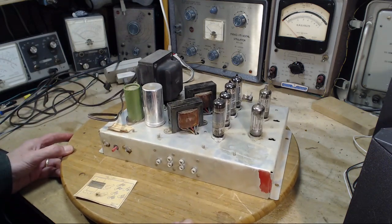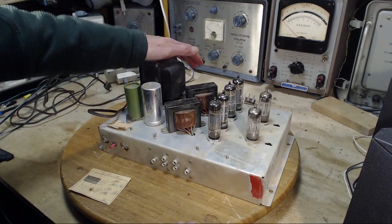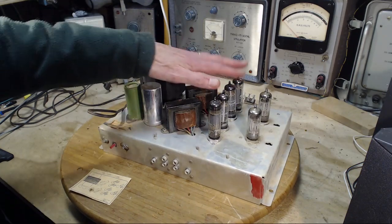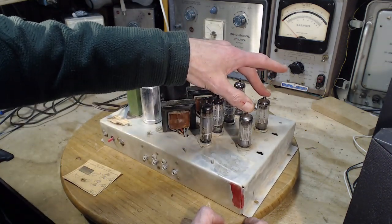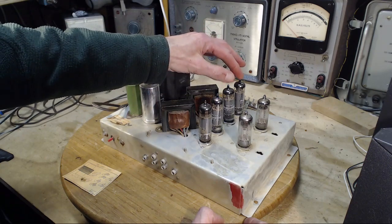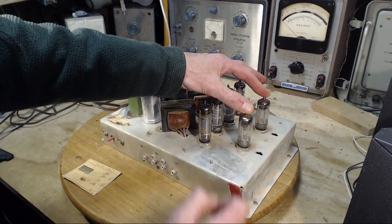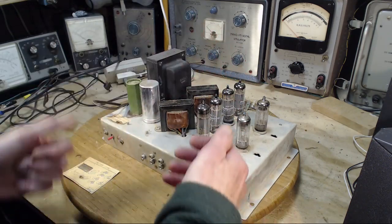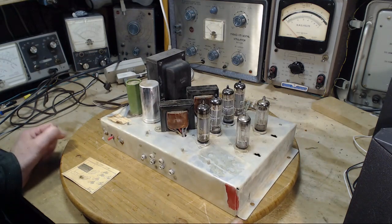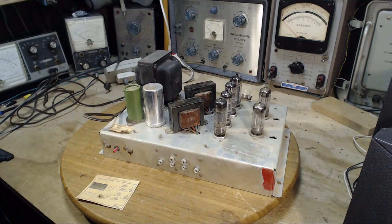So just looking at the top here, it's kind of obvious everything that's on here. Filter capacitors, a great big power supply producing the high voltage with sufficient power to operate these tubes and ultimately operate the speakers. This must be the preamp tubes, and these must be pairs in push-pull. This must be a two-part tube. You can see it's a two-part tube, so it's half preamp for here, the other half preamp for there. There must be on the receiver where the signal inversion takes place, I think, because you need the signal inverted to operate push-pull. So somewhere that's done.